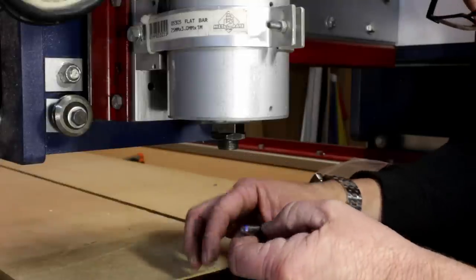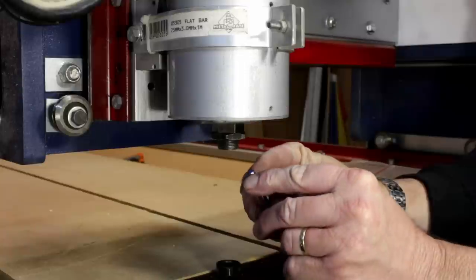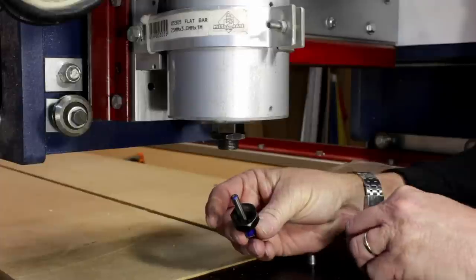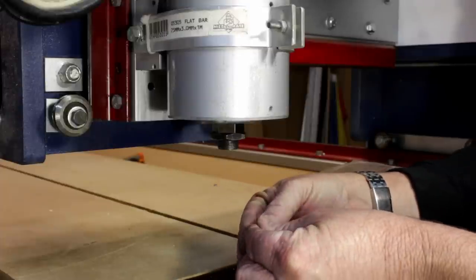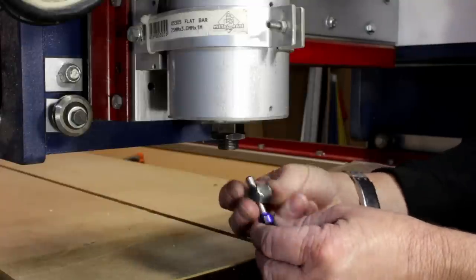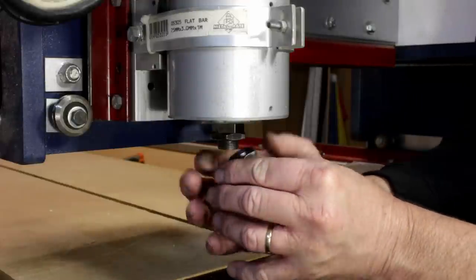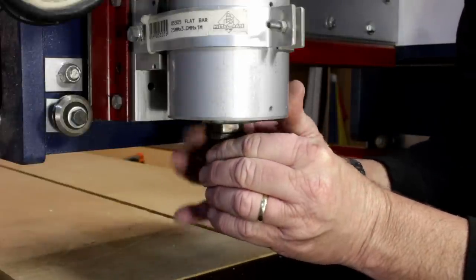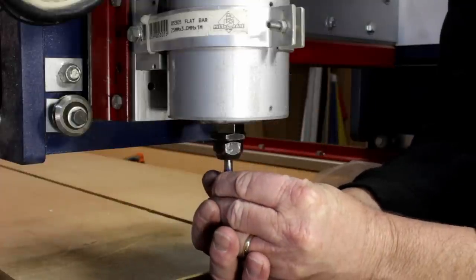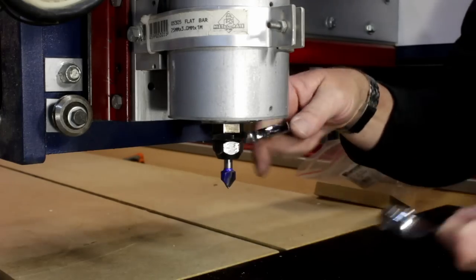What about a V-cutter? It won't go through the collet nut and obviously I can't put the O-ring on the top. Here's what we can do: put the collet nut on the cutter, then put the O-ring on the router bit, put the collet on top and screw it in place. We only nip it up slightly, adjust to the height we want, and then tighten it in place.